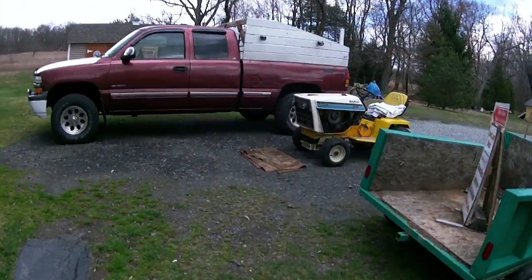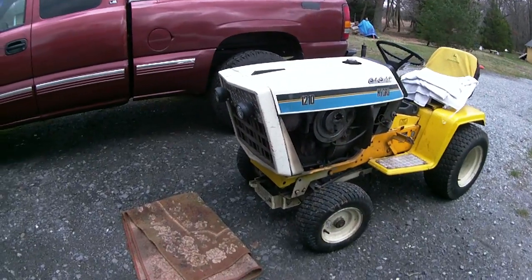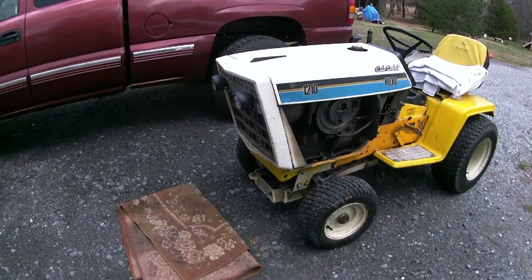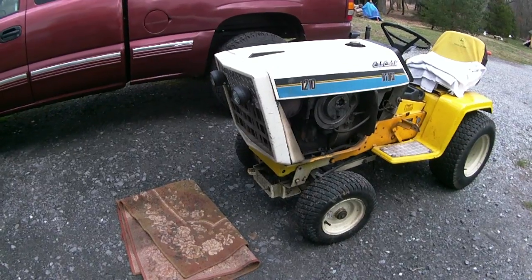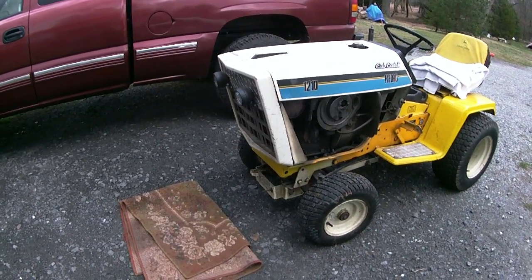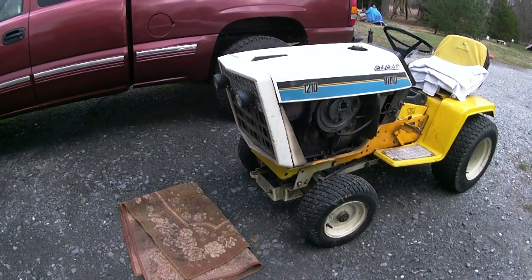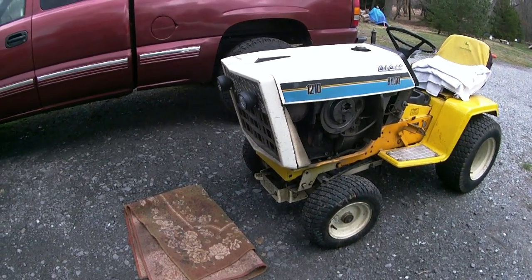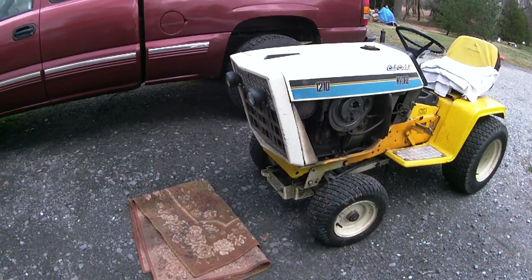I had two engines. The first one I bought off of Eckroth Brothers failed. They wanted to charge me another $700 for another engine, and I realized that that one wasn't going to run because the head spacing wasn't right, and the piston was contacting the top of the head, so something in the bottom of the engine was bad. I ran it for about 2-3 weeks before I shit-canned it and told them I wasn't going to pay them. They kept sending me bill after bill after bill.